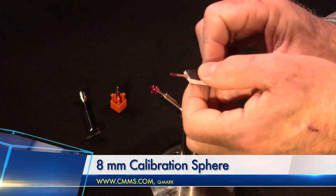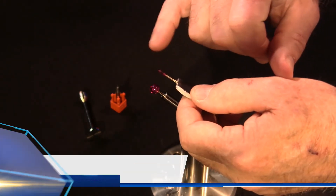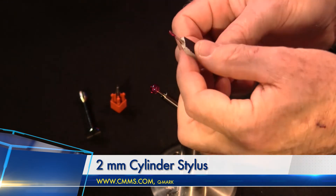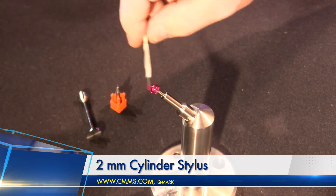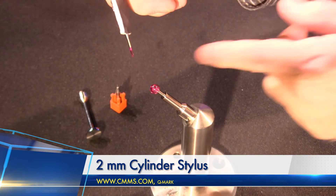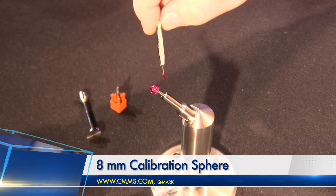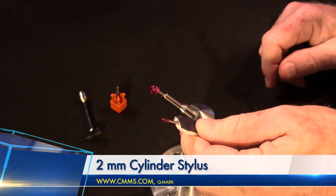And finally, what I have here — I have this stuck in a piece of styrofoam so I can hold on to it — this is a cylindrical probe. The ruby tip here is a cylinder with a curved end on it. That curved end is not a perfect hemisphere, and that's important to note because when you go to calibrate a cylindrical probe, you must not approach your calibration sphere at 180 degrees. Because if you do, most likely the curved tip of the probe will not contact the curved edge of the calibration sphere. You want to come in at about 150 degrees, and at 150 degrees you're going to take your measurement points and use that data to calibrate your cylindrical probe.